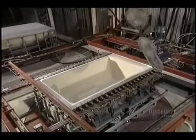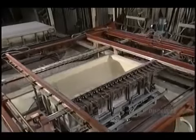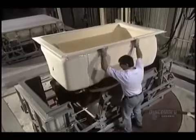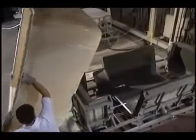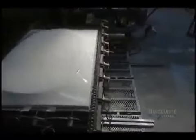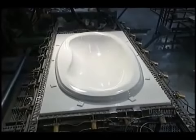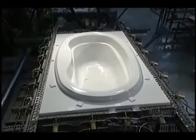The ventilators are then withdrawn. The shell is easily removed from the mold, and that's because it weighs a mere 16 kilos. To make a tub in another shape, they change the mold. They put in another acrylic sheet, which is heated on the ceramic and fiberglass mold. The little holes vacuum out the air, and the job is done.